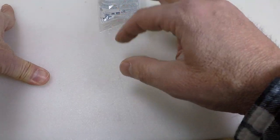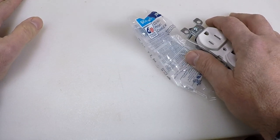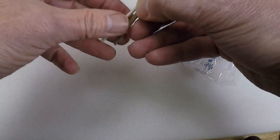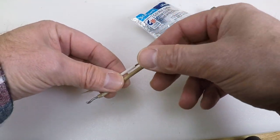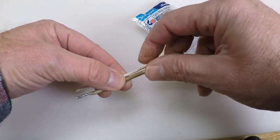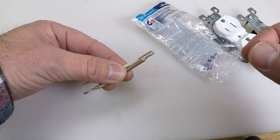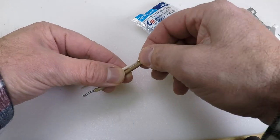The next thing is you hear a lot about pigtailing. What pigtailing or crimping involves is taking a copper and an aluminum wire and crimping them together. There's an industrial-type crimper that puts extreme force on the two and essentially fuses them together. That's pretty cost-effective, but an electrician definitely has to do it. In my opinion, it's not the recommended way to go, but it is an option.